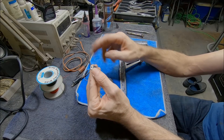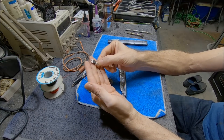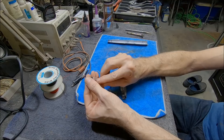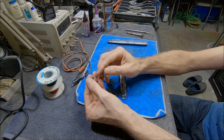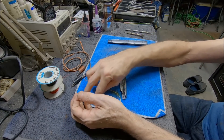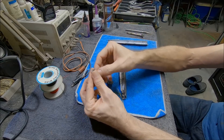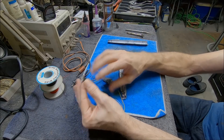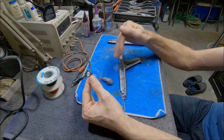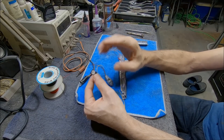I'm using 12 volts on this model, and I'm using a transistor — the L7805 — that takes up to 30 volts in and reduces the output on its pin down to a steady 5 volts. So with 12 volts coming in, it comes out the other side at 5 volts. I'm keeping the motor circuit separate: the power going to the motor only travels through this transistor down through the pylon and into the hull on its own line. Everything else in the model — the control board, strip lighting, SMDs — gets the full 12 volts. This solves the problem: my motors will spin nice and slow.